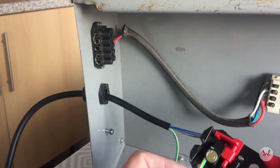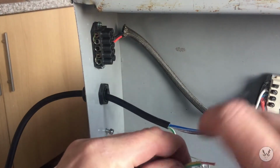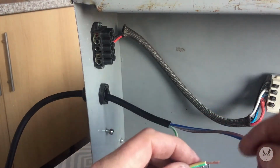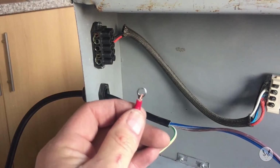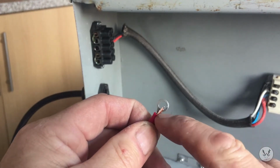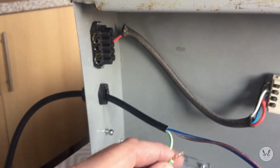And a cable stripper makes the job a lot quicker. So that's stripped. When you do wiring internals like this, make sure all your wires are together and you've got no little frayed bits knocking about. So obviously that's too long, if you can see. Just focusing on that. So I want about 3mm cutting off that. You don't really want any wires protruding. So we'll nip them off.